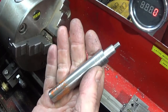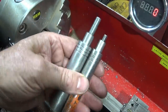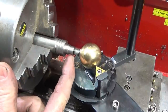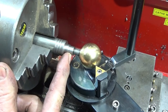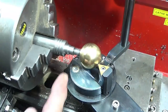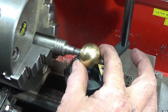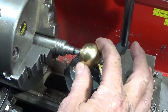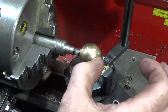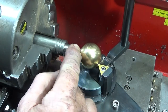Now I have the six millimeter mandrel and the eight millimeter one, and as I need them I shall make the others up until I've got a really nice set. This is the 8mm mandrel back up and you can see I've made a minor alteration - I've turned down the shoulder here a little bit more to give more clearance for the ball turning attachment for the insert to come round. I found that it's best to have Loctite 638 on the thread that's screwed into the mandrel. What I did was put a ball on the end of the thread first, just tighten that on in a vise, and you can use a piece of bar if you haven't got a ball - screw that piece of bar onto the thread.